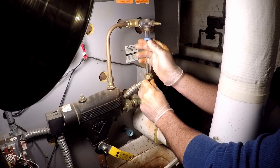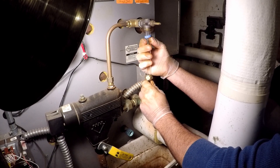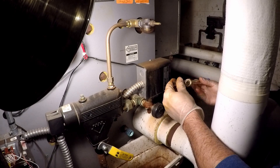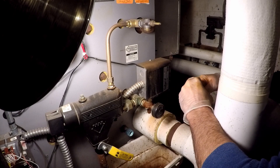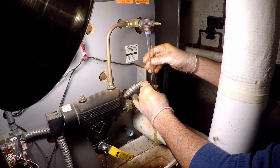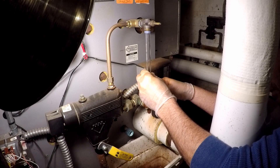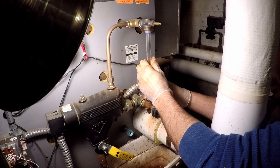You don't necessarily have to have that top valve turned off. Professionals can change a sight glass when the boiler is on — that's when you would need the top valve to be off. Out of an abundance of caution, just being a novice, I decided to make sure this thing is completely off. You're just kind of putting it up in there, which gives you enough room to swing the glass into the bottom opening of the bottom valve. There's no flexibility in glass at all — that's why you cut it to the specific length you do.